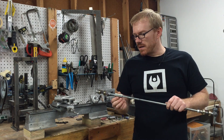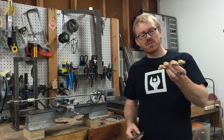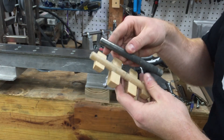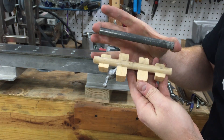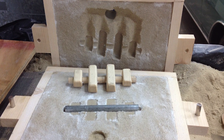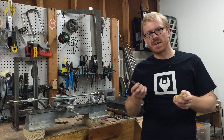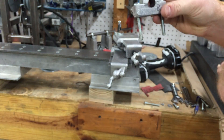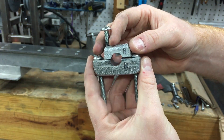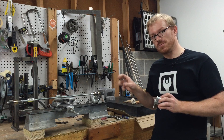The lead screw has journals on either end — it's a threaded rod that's mounted in bearings. This is the pattern that I use to cast the bearings. When I put it in the sand mold and took it out, it leaves a little channel where you put a piece of steel rod. When you close up the pattern, the steel rod forms a little void and you can just knock it out of the metal pieces. You're left with these aluminum pieces that form clamps for the journals on the lead screw.